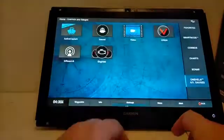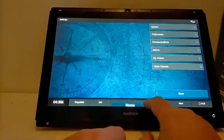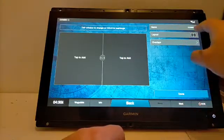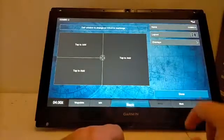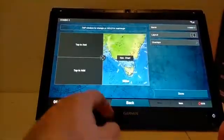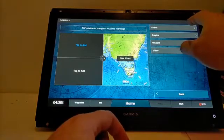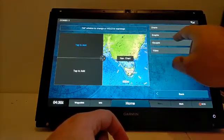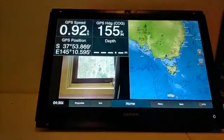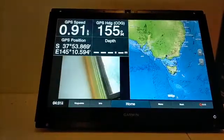What we can do is go to Home, then Combos, and create a new combo. Go to Combos menu, Add Combo — let's have three screens. Say I'm navigating at night time: on the large screen I want my navigation chart on the top left, then vessel gauges, and down here we'll have Video HDMI main helm. Done. Now you can have your night vision camera down here along with a few other screens too, and if I move the camera around you'll see it appearing in that combo panel.